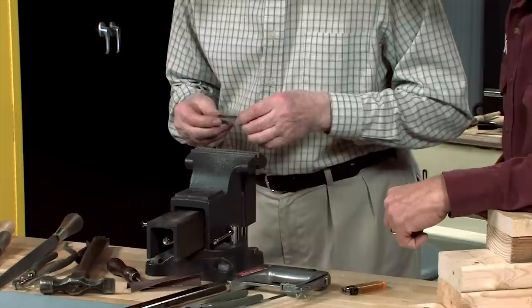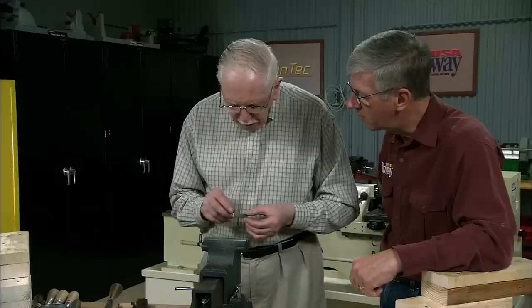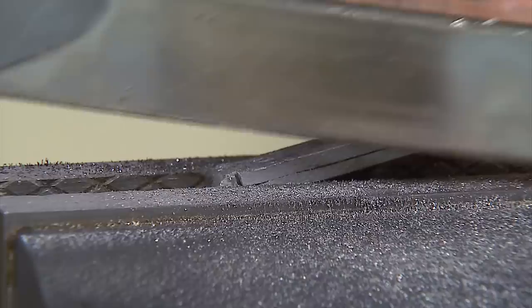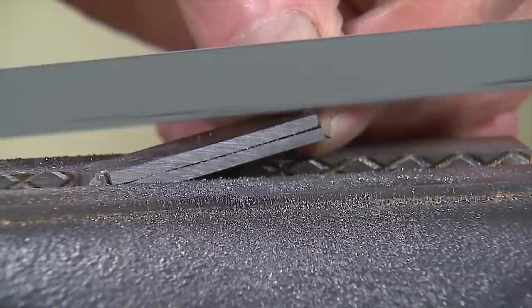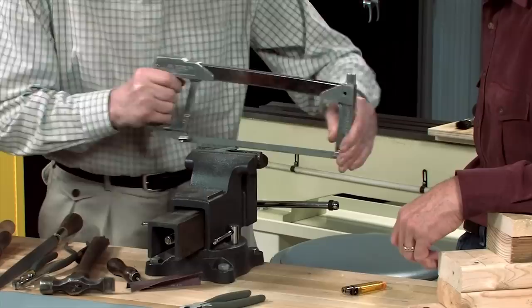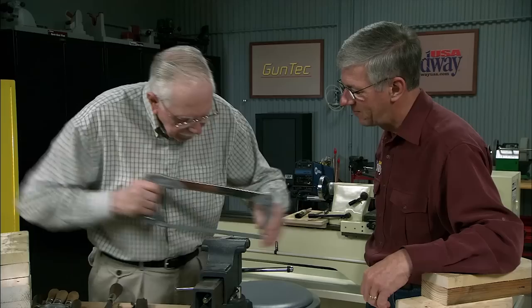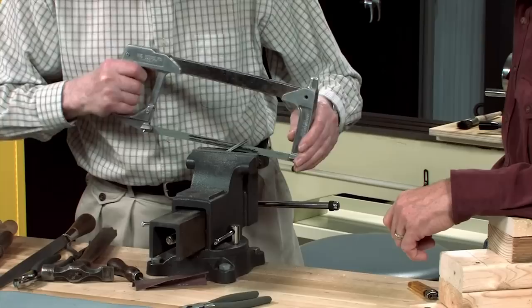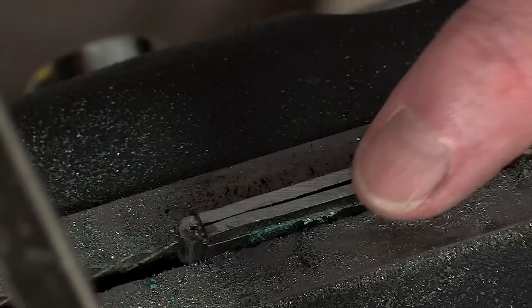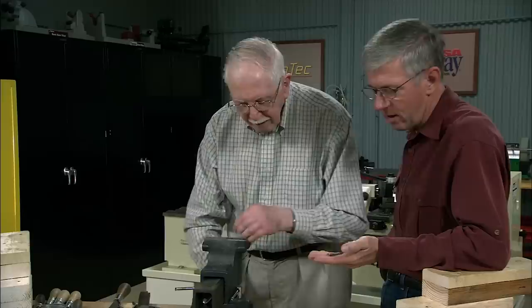Let's dress that side up. We'll call that the top, we'll call that the bottom. The bottom's where we're going to file the little leg on — I'm going to leave the leg on the bottom. The next move is to saw down rather than file it off — sawing will save you time. Use enough file, and never file if you can saw. We've just about got to the bottom of that slot there. Those two strips are hanging by a thread. And there we go — those parts are out.